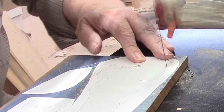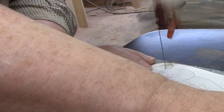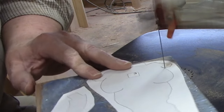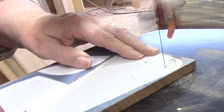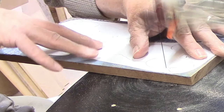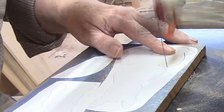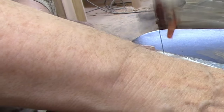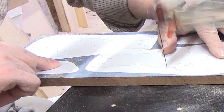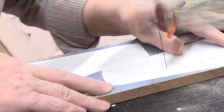I chose to cut the accent here before continuing on. I followed the curve around the paw and kept cutting to the end of the accent mark. I wanted to keep this as just a line, so I backed the blade up to the intersection where the line started upwards along the side of the dog's body. If I had tried to turn the blade around at the end of the accent mark, it would have left a little circle and I didn't want that. I followed the cut line up along the dog's body, and there was no doubt on how to cut the second accent — the curve for the dog's leg continued smoothly into the accent, so I kept following it until the line ended. It was easy to back the blade out to the vertical line, pivot the workpiece, then start cutting again.